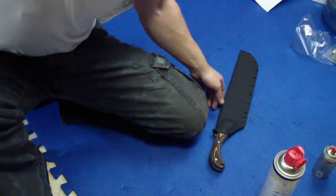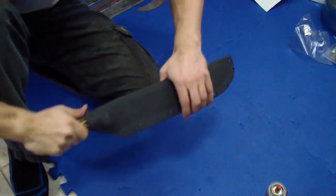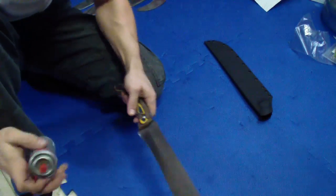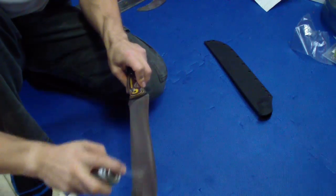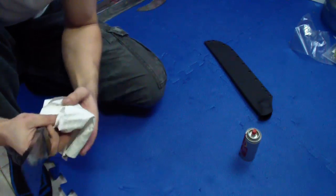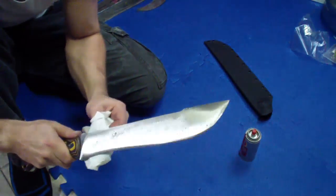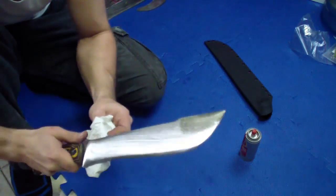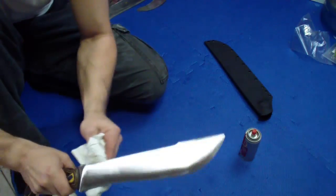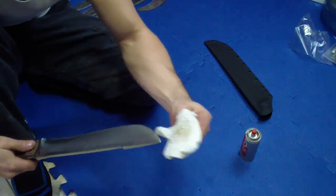Nothing fancy, but works great. And the last step as I mentioned — I always coat the blade with Fluid Film. It's great, it's FDA approved, it's food safe — you can prep food with it without worrying about chemicals. It's sheep lanolin extract. Protects the blade from rust and it actually makes it look pretty cool — creates kind of like a film. So that's always the last step. Up till now everything was WD-40, but the last step: wipe it and coat it with Fluid Film. I hope you enjoyed it guys. Thank you for watching. Take care, stay safe, and remember — don't cut yourself.